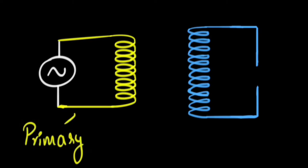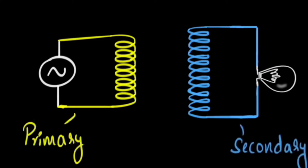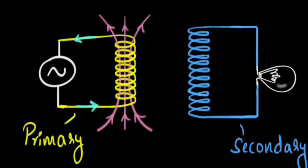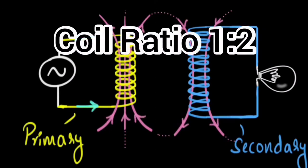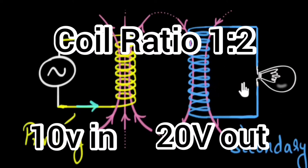We're almost there — we just need one more piece of electrical theory about how we generate high voltage. We already talked about how sending current through a coil of wire creates an electromagnetic field that stores energy. These two coils you're seeing right now form a basic diagram of a transformer, which is used pretty much everywhere in your house electronics. In a transformer, we pass current through the primary coil, which has fewer windings than the secondary, and it generates an electromagnetic field. That field, in proximity to another coil, induces current flow in the secondary coil. The ratio of windings in the secondary compared to the primary determines the output voltage — twice as many windings in the secondary means the voltage is doubled on the output.